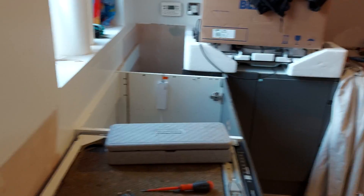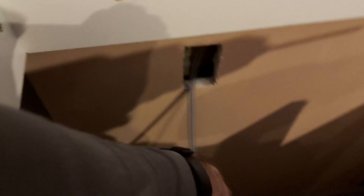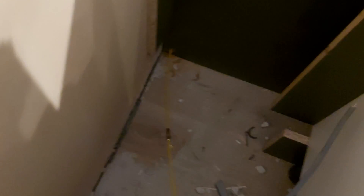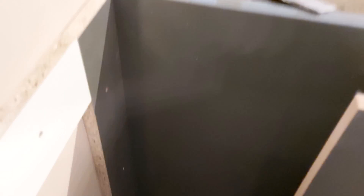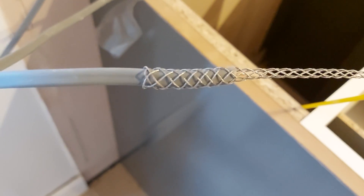I hate working around kitchens fitted first — it's just ridiculous. I've managed to get behind the board here, put a grommet in the back of that box — a bit tricky. This one here is in a dead corner, so I've just got the board. I'll pull that through, drill the hole right down there, got some rods through behind the dishwasher — just what you need. I can get a cable sock on and pull that cable through behind these base units and the dishwasher.